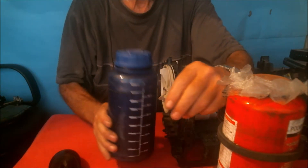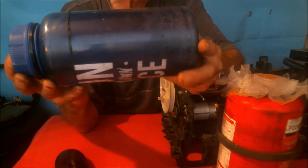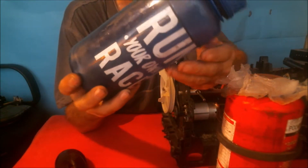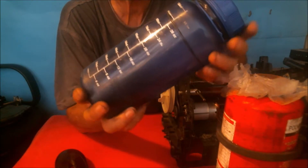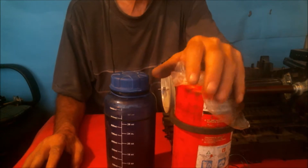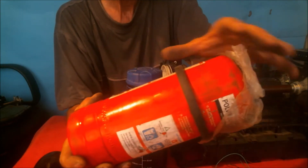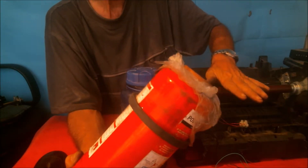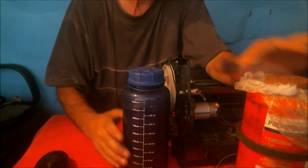For the polishing mill I am using a plastic jar that has a sealed cover. Polishing media is something you will have to buy. You can practice a bit with sand — different grades of sand — but polishing jewelry and stones requires special materials. Both the polishing cylinder and the grinding cylinder have to be lined with two rings of rubber around both ends to create enough friction between the cylinder and the rollers, because without that it will tend to slip. This jar is quite heavy and even still tends to slip when the rollers are turning.